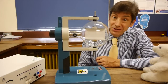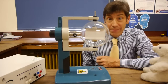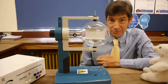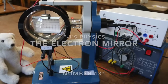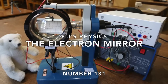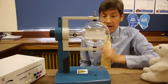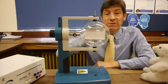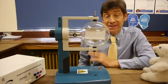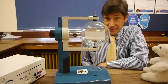Welcome back. Today we have an absolutely fascinating experiment: the behaviour of electrons in electric and magnetic fields, called the electron mirror. To do this experiment we need a fine beam of electrons shining onto a fluorescent screen so we can see how they're travelling. Once we've got our electron gun working, we put a magnetic field at 90 degrees to the direction the electrons are moving, and if we get the settings right we'll see the electron mirror.